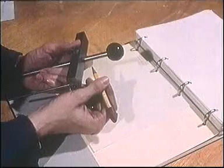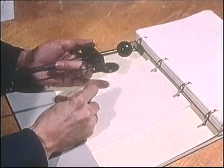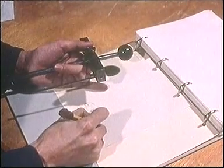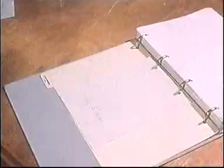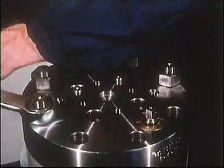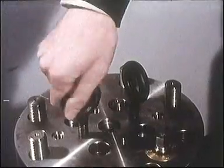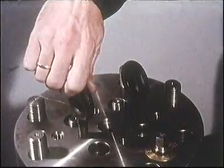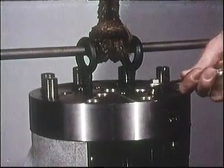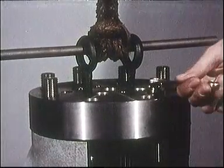Now lift the tool out of the pump and note down the measured result. Remove the 4 cap nuts and the 8 fixing nuts of the top cover. Insert 2 eye bolts in the threaded holes for the screws of the high pressure pipe. Turn the adjusting screw anti-clockwise to separate the top cover from the pump barrel and housing, and carefully lift the top cover by means of the crane.